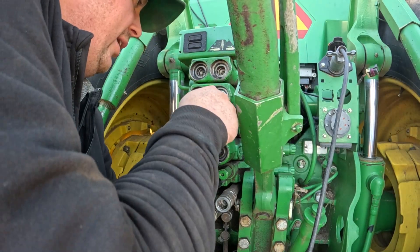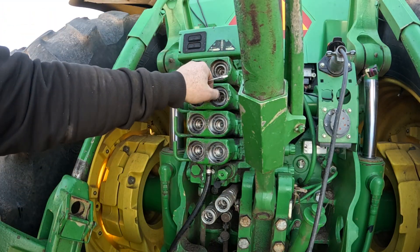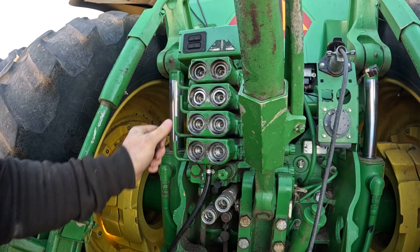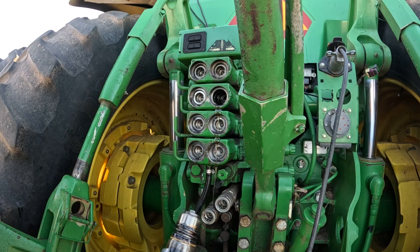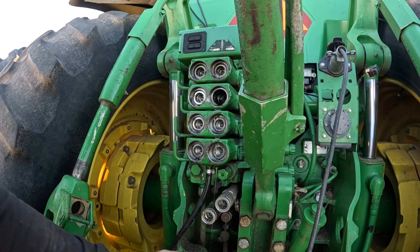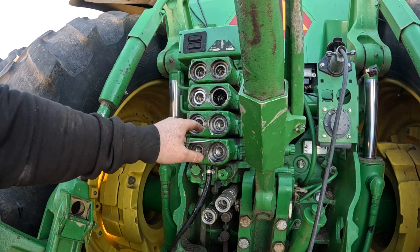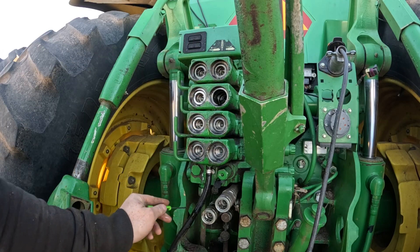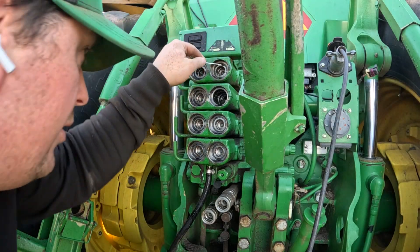There is a small snap ring that you gotta peel out of there — I like to use a little pocket screwdriver. Peel that snap ring out, push your lever, and it'll pop that coupler out. The o-ring, the whitish-yellow o-ring, sometimes will blow out, and when it blows out you'll have a ton of oil coming out everywhere because the covers are on there and it's coming out of the drains. The little slots right here are the drains — they connect in the middle and go down through the bottom hose. I always like doing them all at the same time.